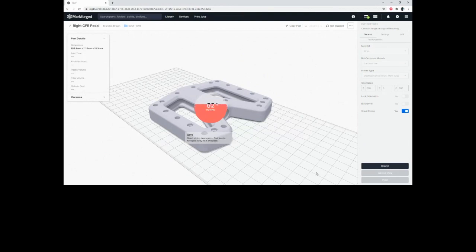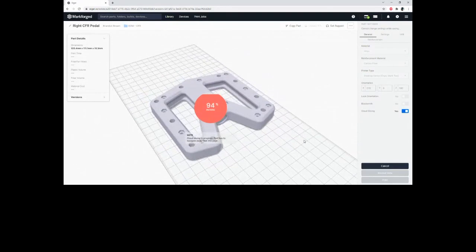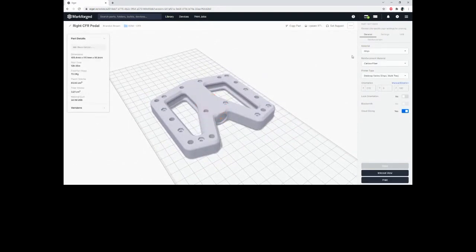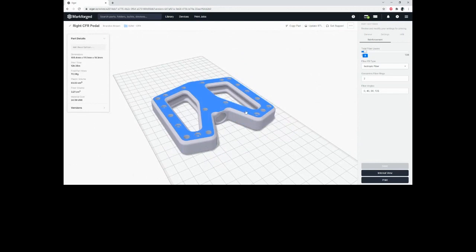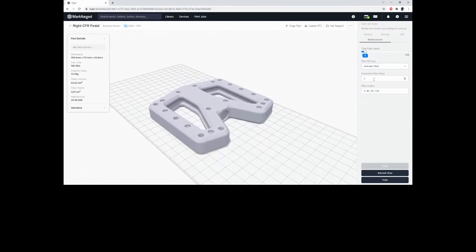While Kevlar would probably be a fine choice as well, this is what I personally ended up going with to make the pedals as light as possible and really eliminate some of the internal mass, as we'll see, by allowing the infill to persist. We've updated this already, but by default it adds 4 layers in the top and 4 layers in the bottom of isotropic carbon fiber. We can change this a little bit, but this number is divided by 2 between the top and bottom layers. This really helps us right off the bat. This is what we want.